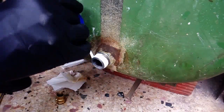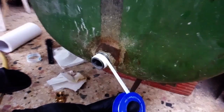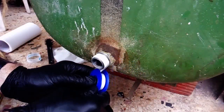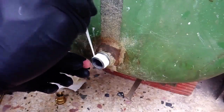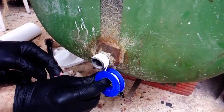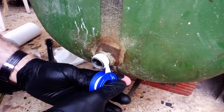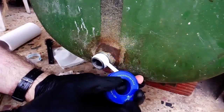The tension I applied was too much and it cut the tape off, but that's not a problem — we can continue from that point upward to the end, and then slowly work our way back down. I keep the PTFE tape not parallel to the thread so as much of the tape as possible is applied on the part. You'll notice I'm using as much PTFE tape as possible — that's an amateur approach — because I want to make sure the diesel fuel connection is fully sealed.